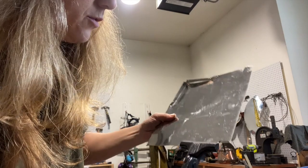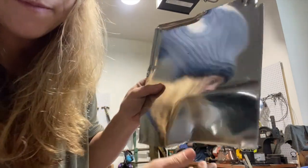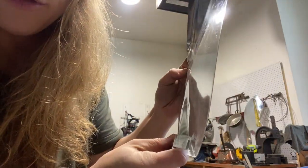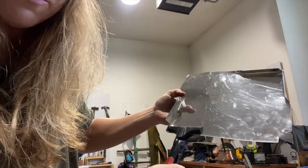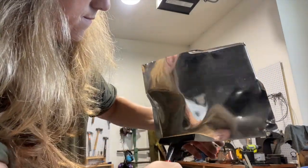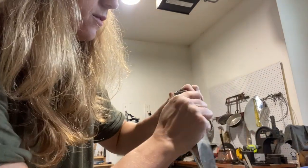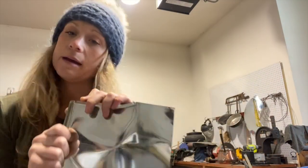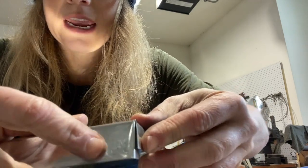And then I'm going to go next to the tab. And I'm going to bend that up also to 90 degrees. Now I have the whole thing at 90 degrees. See it? And then I'm going to go right up alongside my tab. I'm going to move this so it fits. And I'm going to pull that in, also at 90 degrees. And now, it's not measured, but you can see. Now I have another 90 degree corner for a box, a pan, a baking sheet, but there is a seam. These are just separate sizes because I didn't care about this, but there is a seam.